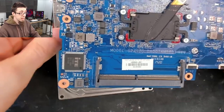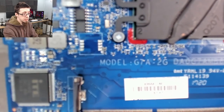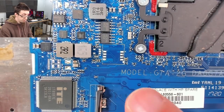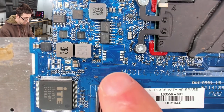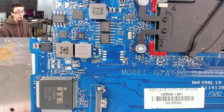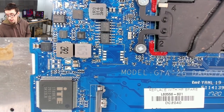Something I forgot to mention before taking it off: when you're removing BIOS chips it's really easy to knock components sideways — ask me how I know. So strongly recommend — if you're not videoing, take a picture. I know it sounds pedantic but take a picture of the area so you can see if you've knocked loose any of the little capacitors or resistors nearby. If you knock them loose or blow them away with the hot air, it's very easy to just not notice.